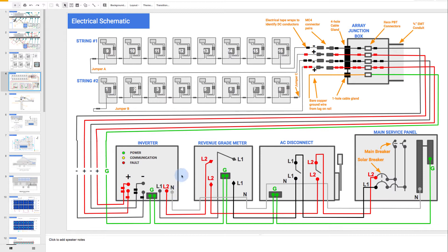We show the inverter here as a single box. There's more video on that by itself. But the idea is that there's an upper portion here that actually is the electronics for the inverter, converting DC to AC. And then down here, this is the detail of the DC disconnect switch part of the inverter.